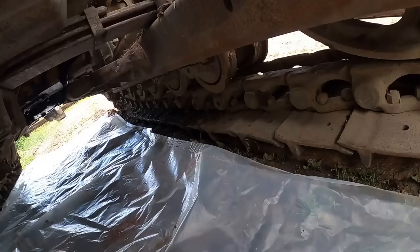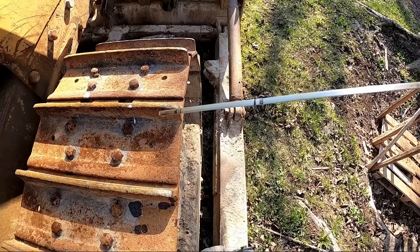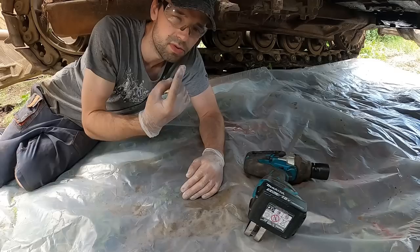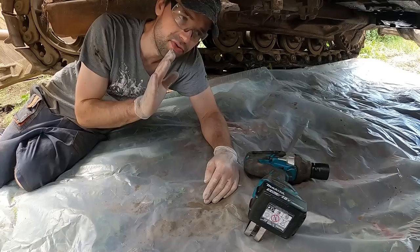About the engine oil, maybe some of you remember, that thing was severely overfilled. So you can see that this thing is severely overfilled over the maximum. Also, the oil pressure was very low. It was sitting on one. Now, by the book, one is absolute minimum.